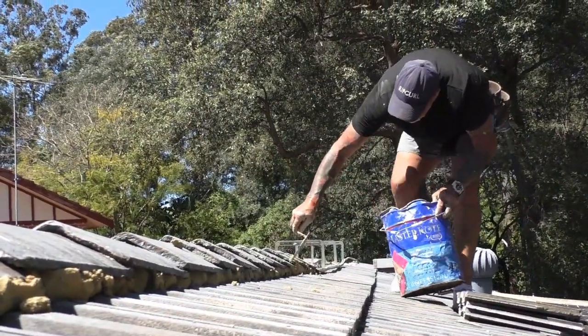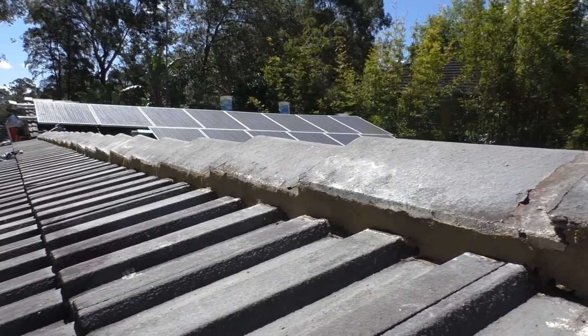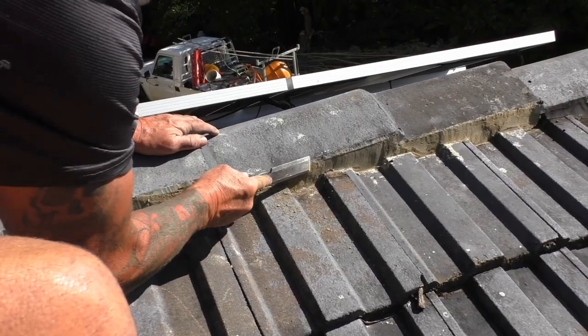What are some common problems when it comes to the installation of the bedding and the pointing? I think I see some areas where roofers put a lot of cement in their bedding, and as a result it's just so hard. The bedding's not supposed to be one part cement, one part sand — it's roughly about three to four parts sand and one part cement. I've definitely come across that issue, and it's so bad that you end up having to break the tile if you're going to remove it. There's no need for it, because the only purpose for the bedding is to hold the ridge up. You're supposed to wait till the bedding dries up sufficiently so that it's set and actually holding the ridge up, and once it's done you clean the bedding away and prepare that for pointing.